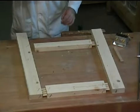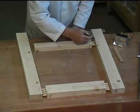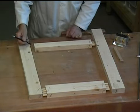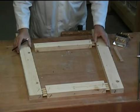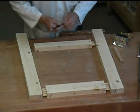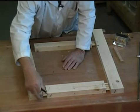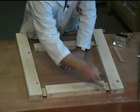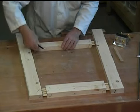Now, to begin the process, I have drilled all 3 joints here, but left this one for demonstration. We mark all reference surfaces with the check marks and X's. Check marks on these 2 reference surfaces, these 2 reference edges, surfaces and edges, surface and edge here, surface and edge here.